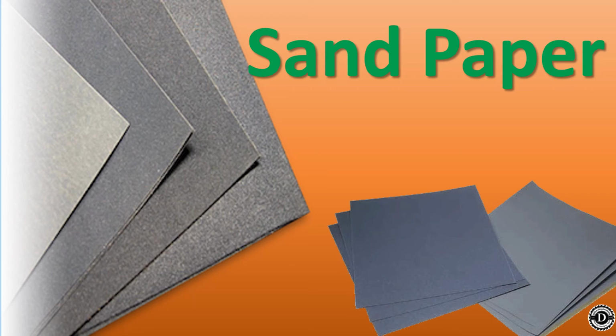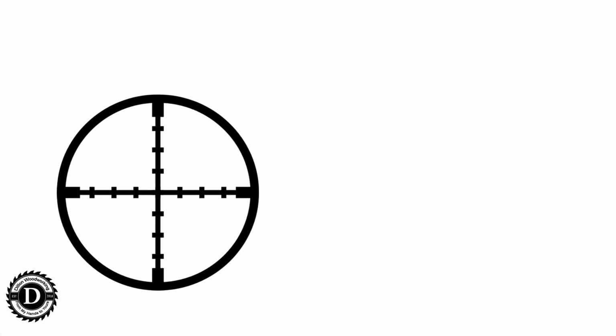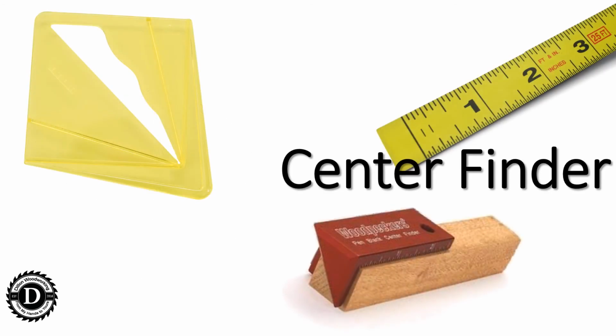You will want to get sandpaper or micromesh in several different grits. This will help finish off your projects, making them nice and smooth and finished to look like glass. You will also want to get a center finder. They can be small for finding the middles of pen blanks or as large as turning big logs. A true center of your project helps make for an easier, more evenly turning project.